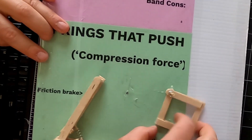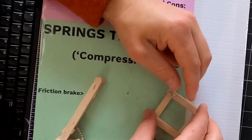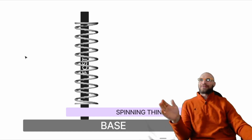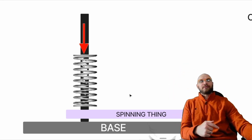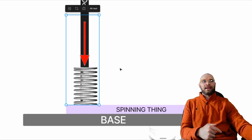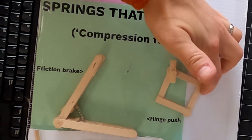Then what I'm going to call a friction brake over here. This piece spins pretty freely — I don't like how much it spins, I want to be able to set it somewhere and have it stay there. So I have a spring on top of it, on top of this post. As I squeeze down, that is going to lock it in place. Here's a side view: I've got my base at the bottom and my spinny thing with nothing really holding it on top — the spring has no weight. As you press down on the spring, it presses more and more, and the spinny thing gets pressed into the base and gets harder to spin. The spinny thing is getting pressed down, and we need to glue a cap right at the top. This little piece is going to slide down the post; I'm going to compress the spring about halfway and from there it's going to really make this hard to move.